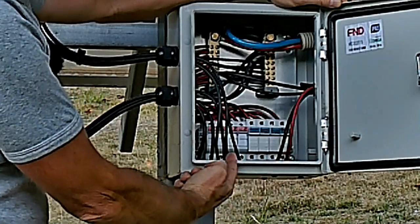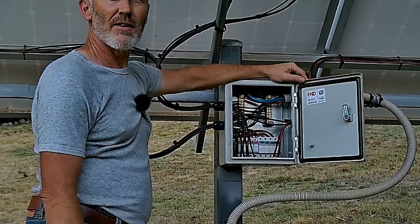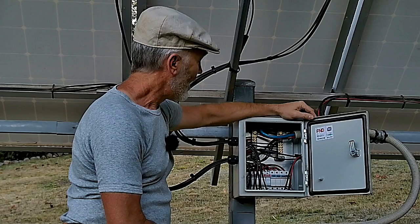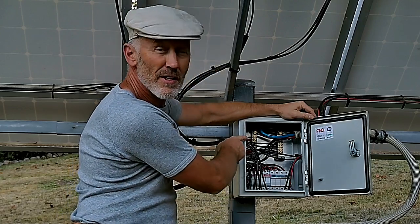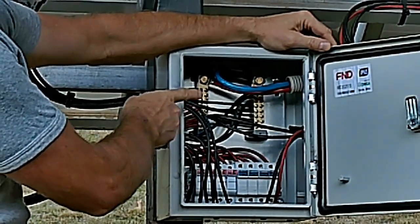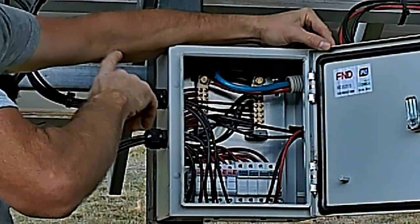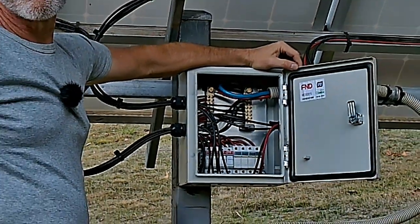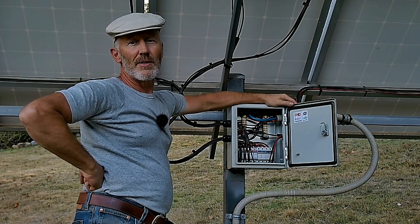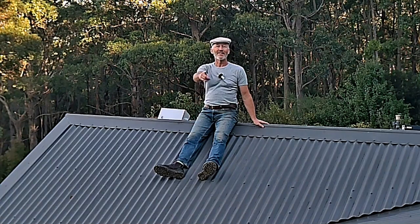There's one fuse for every positive cable, so if there's a problem in any one panel it won't take out the entire array — which matters because these problems usually happen in the middle of winter. All those cables connect into these big chunks of copper — one for positive, one for negative — which collect all the electricity and send it into much larger cables. Those cables take it up to the house into the battery room. This stuff is really basic, but with this sort of technology you want to keep it fundamental, simple, and repairable so it's easy to fix. Thanks very much for watching — see y'all next week!